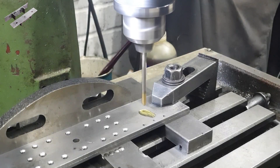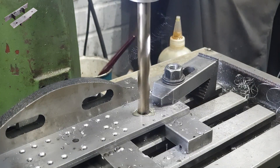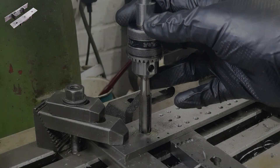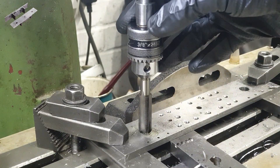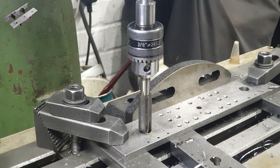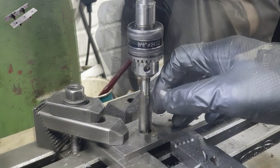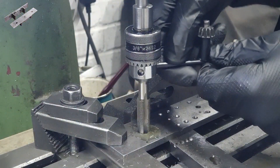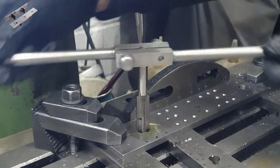The holes for the buffers need to be opened out and tapped at half by 32 TPI, model engineering thread, and for that thread I need to drill the hole out to 11.9mm. Unfortunately my homemade tapping guide doesn't have a T-bar, so when it comes to large diameter taps it's very difficult to get a grip to cut the thread. Rather annoyingly my half by 32 ME taps are not centre drilled at the end, so I can't even use a spring follower — so please do excuse what I'm doing here with the chuck key. Once I've got the thread started though, I do return to more conventional means for finishing it off.